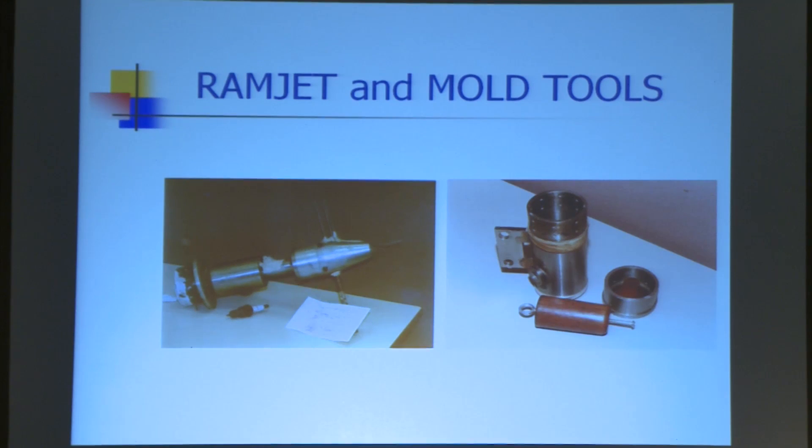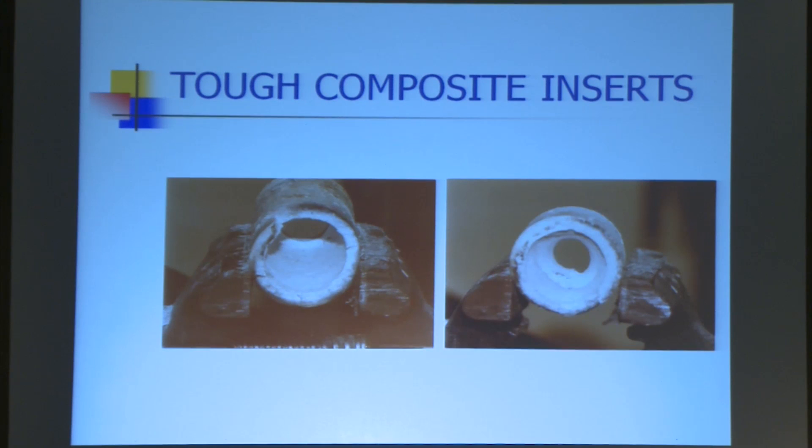This is the little tool that I did three decades ago. This guy here is a little boilerplate heavyweight ramjet tool. This engine right here is about the size of a coffee cup. These over here are the tools I used to mold the insulator. The first time I drove that little ramjet into rich instability, that insulator shattered and it spit it out on the ground and lit a grass fire. So I thought back to what me and my dad had done making fiberglass canoes, and I went and got some fire curtain cloth and made a ceramic composite material.